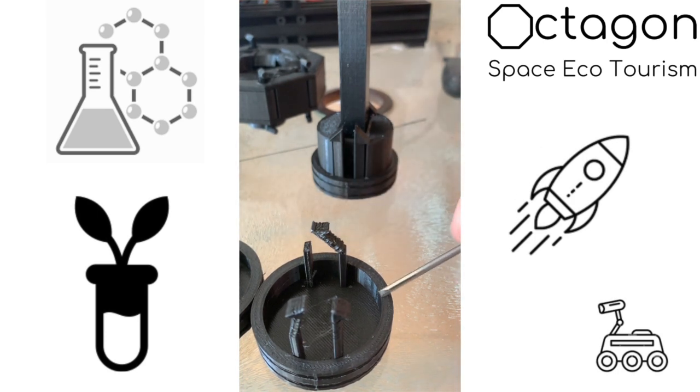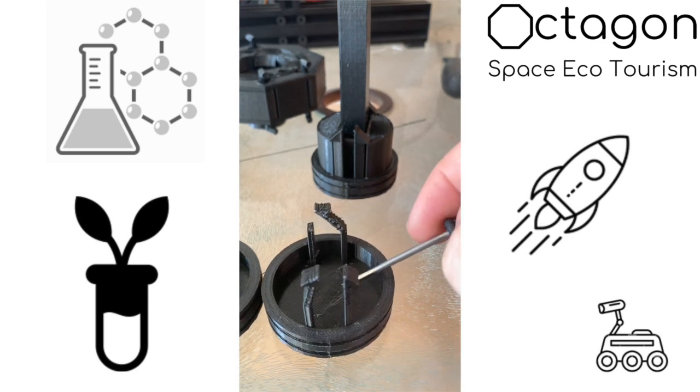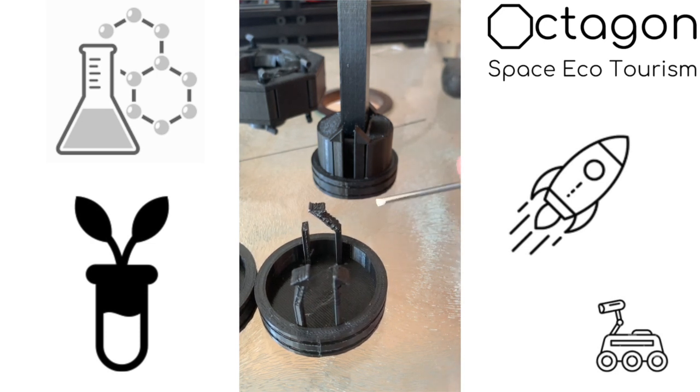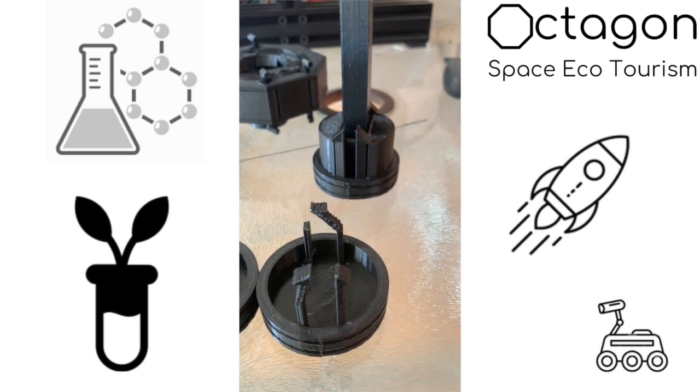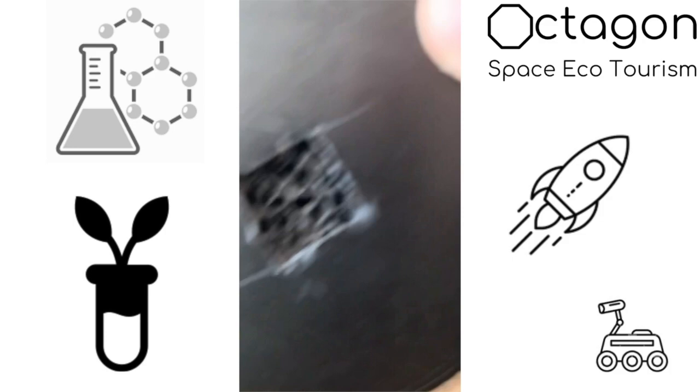So most of these here, my goal is to do 100% infill. This is 2 millimeters thick, 4 millimeters thick on the piston head, 4 millimeters thick on the wall, so that it lasts. But sometimes some of these I ended up printing with 40% infill. So that's the graveyard tour, or the important graveyard tour for today, or what brings us to the junkyard. And with that, I'm going to talk about a few other failed prints so far on this project. So once again, talked about the main gear, this guy over here.